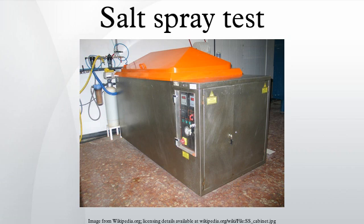The salt spray test has little application in predicting how materials or surface coatings will resist corrosion in the real world, because it does not create, replicate, or accelerate real-world corrosive conditions. Cyclic corrosion testing is better suited to this.